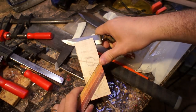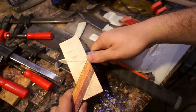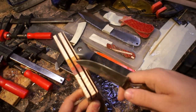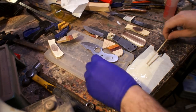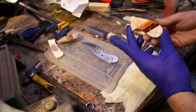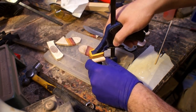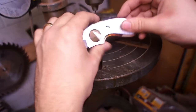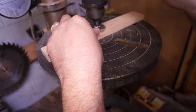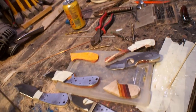You'll want to make sure that you have a very sharp knife for this next step. You'll want to cut through in the middle and make a very flat cut so that it's flat against both sides of the knife blank. When you go to glue it together, I went ahead and trimmed these down to rough shape on a scroll saw, just so I'd have a little bit less sanding to do. I'm using two-part five-minute Devcon epoxy. I get one side done, then I can drill the pin holes through after I drill them through that one side, then I can glue on the other side.